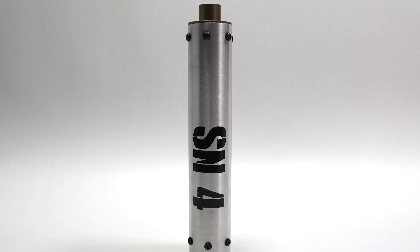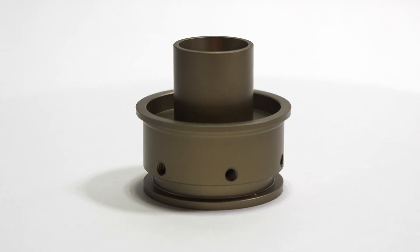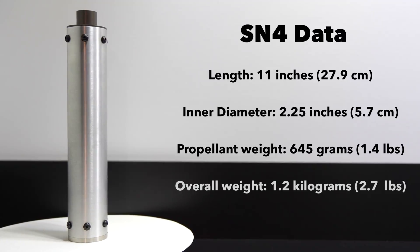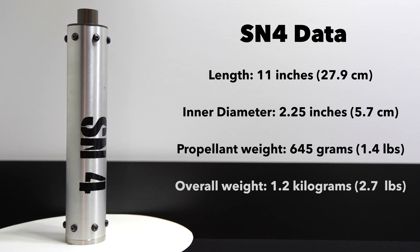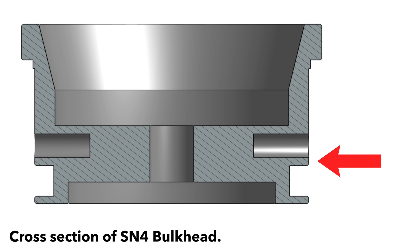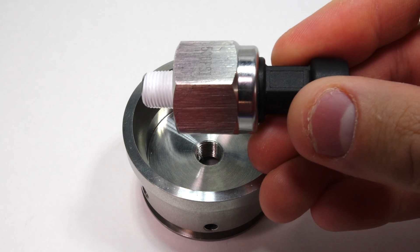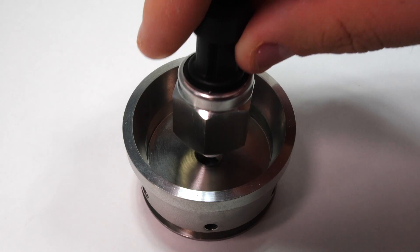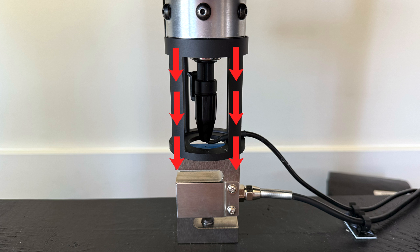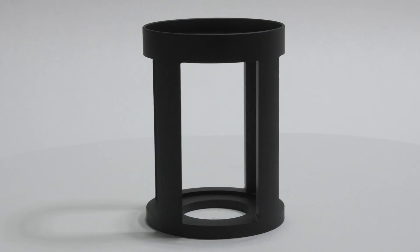The goal for SN4 was to reduce dry mass even more by using a new material for the nozzle: hard coat anodized aluminum. I was skeptical if it would hold up, but the only way to find out was to try. SN4 had the same nozzle geometry as SN3, the same casing diameter, but the motor was a bit shorter and used 645 grams of propellant. Taking lessons from SN3, I moved the radial bolts further from the casing edge, but that shifted them closer to the o-ring groove — which became its own problem. This was also my first time using a pressure transducer: I drilled a 1/8-inch MPT thread into the bulkhead and packed the sensor with grease for protection. To make sure the force went through the load cell and not the pressure transducer, I designed a custom adapter to isolate the pressure transducer.